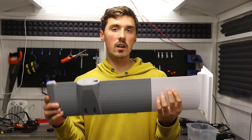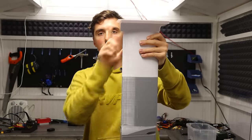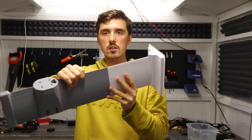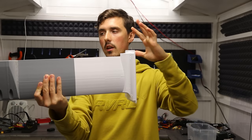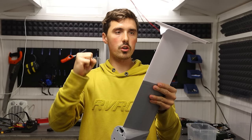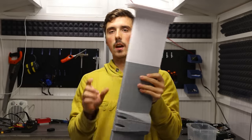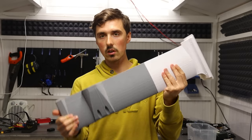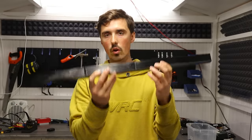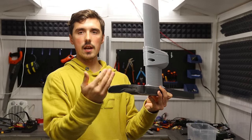I went to my computer and redesigned the two masts in Fusion 360 with some obvious improvements. It's now 40% shorter to decrease the leverage arm from the base where the surfboard is attached, so the motor doesn't have as great a leverage arm to break it. The base is now not only larger but way thicker — a huge amount of plastic, very heavy. I increased the print temperature a lot so the plastic is more merged together. The width and X/Y dimensions of the wing are larger — not taller but wider — and it has far more perimeters and way more infill, so it's heavier but hopefully a lot stronger. The horizontal mast was also redesigned and is now a lot larger with the new print settings. The vertical mast slots into the horizontal mast and I'll reuse the wings.